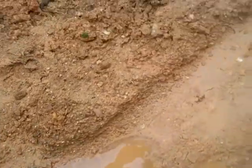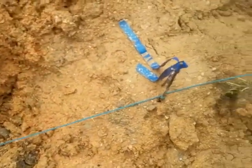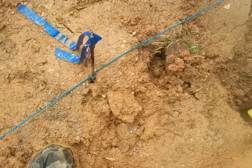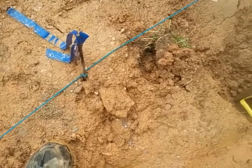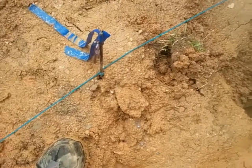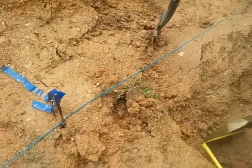But what'll happen is, this is just runoff at the same spot. It's not really actually that muddy everywhere else. But what I'll do is have them start over there by the structures, put the tape down, or no, that's not it, put the screenings, well, dig far enough down, number one. And number two, once you hit the depth, do the screenings, 3 inches around whatever pipe. So the bigger the pipe, the more inches of stone screenings you need.